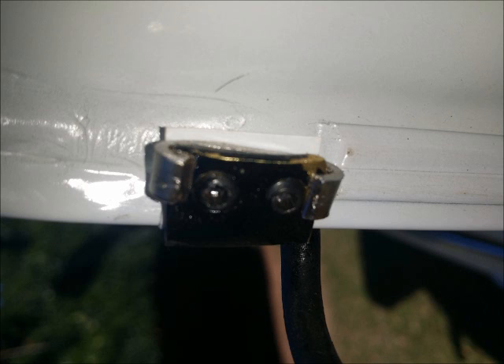One of the comments that you will probably hear people say is that the grub screws actually have to penetrate the body of the boot for good grounding. The thing is, if your coaxial cable is grounded well at the radio side and the radio is well grounded, it doesn't have to be grounded with the grub screws. The coaxial cable is not going to reduce any wavelength — it's a perfect match, 50 ohms with the radio, or at least a perfect impedance. So you're not going to have any problems that require grounding it.